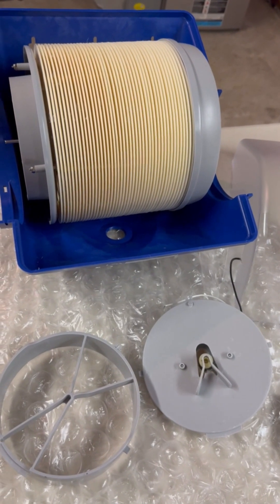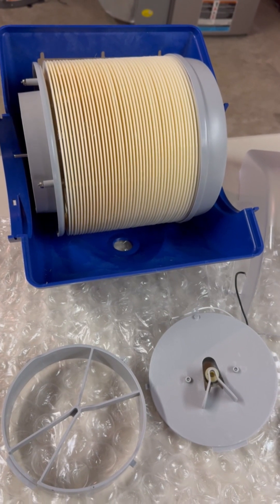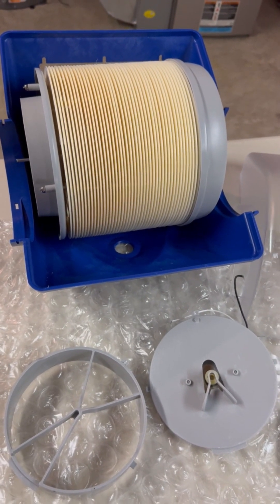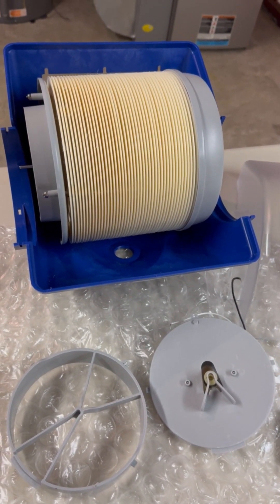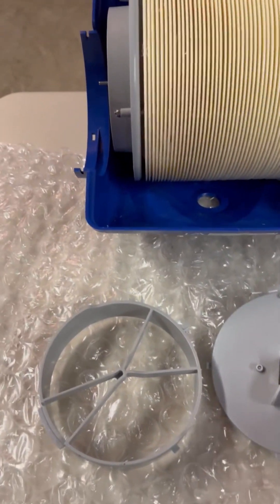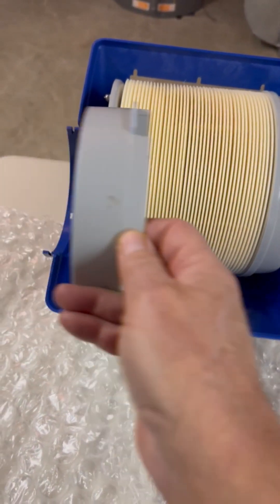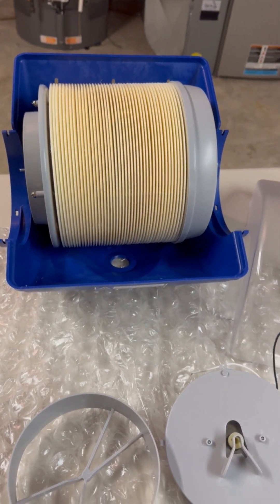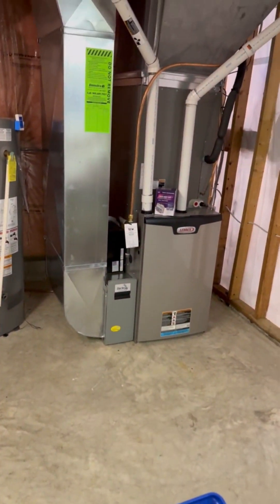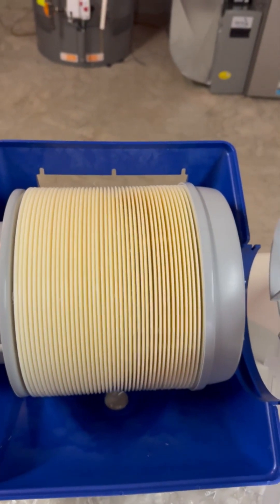The instructions say this humidifier should only be installed on the cold air return and not on the plenum. I have no idea why — maybe the heat of the plenum might affect it — but I'll follow the instructions. The unit comes disassembled with a drive side and a takeoff side, and you can mount these on either side. In my case, my return air is on the left and my plenum is on the right, so I'll put the drive motor on the left and the air takeoff on the right.